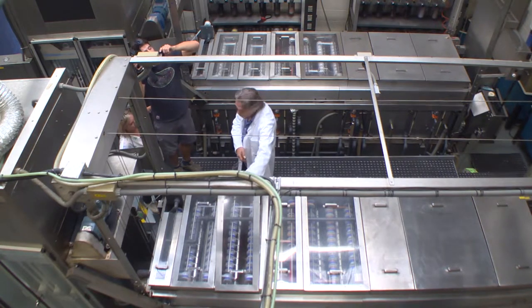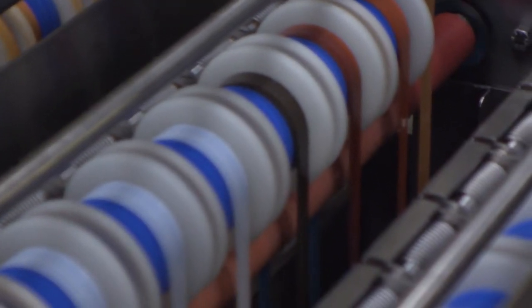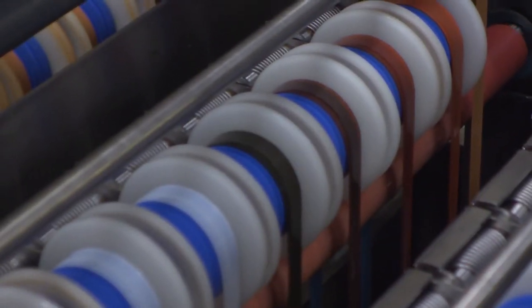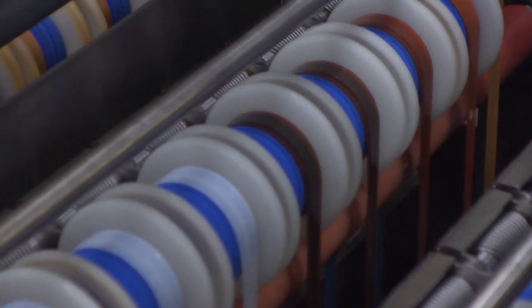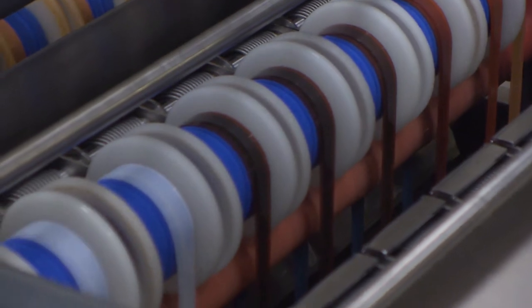This is the fix, and you'll be able to see here. You can see the film changing into an apparent image while it's in the fix, okay? So it comes in as this kind of overall orangey color into here. If you held this up to the light now, which you'll see shortly, you'll see it is actually the image that you've recorded in the camera.